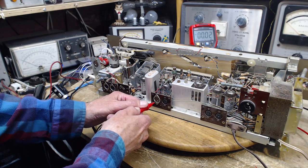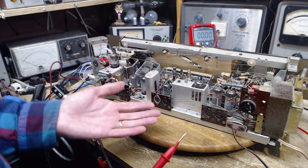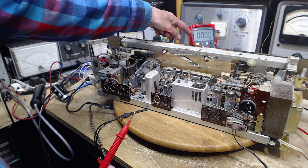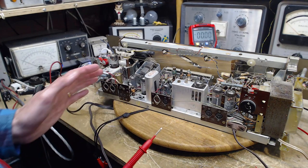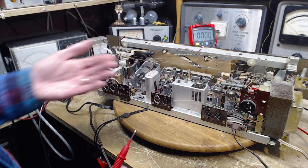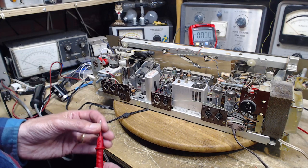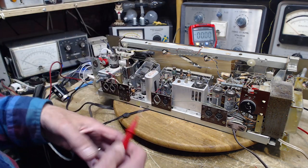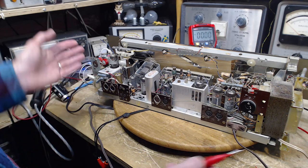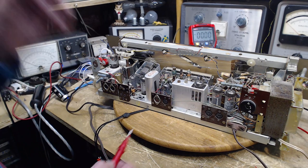So what this is telling me is, A, the meter falls to zero, which means the charge that's building up on this terminal is being completely dissipated just by the voltmeter itself. It's pulling it right down to nothing. Last time around, it could pull it down to, I think, a 23 reading here, because there was so much charge leaking through the capacitor. There still seems to be charge leaking through. It must be that what we're testing is essentially an open circuit, and every capacitor leaks to some degree. And I guess in this case, the ones I put on there are leaking enough.